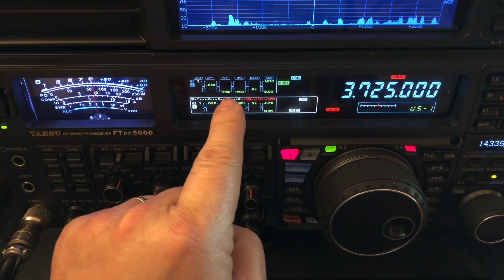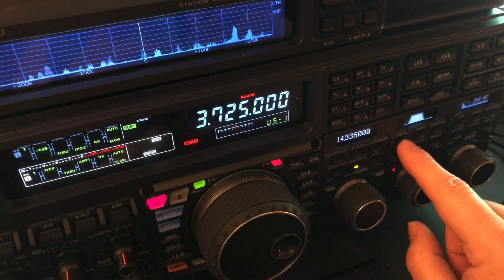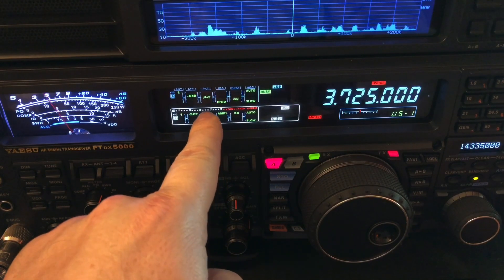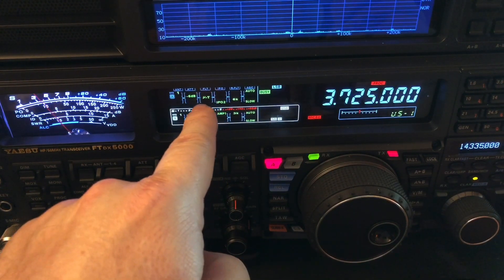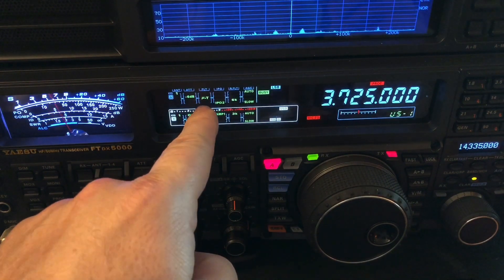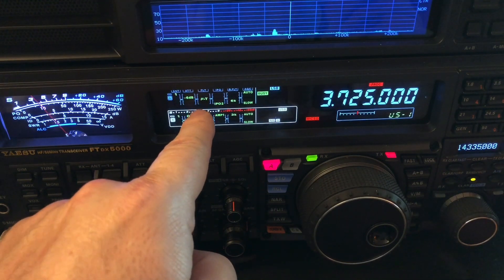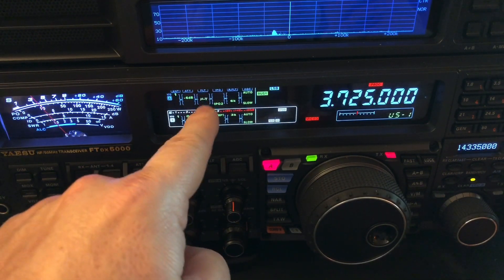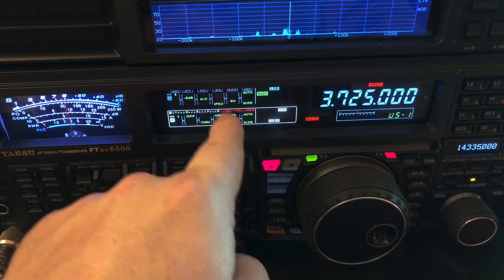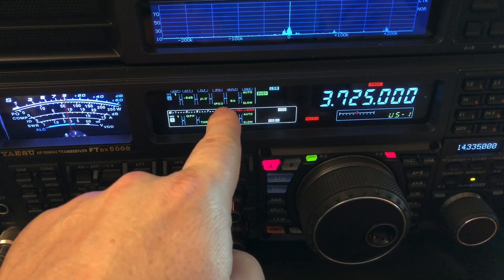If I turn on the mu tuner — it's a button right here — watch the display and you'll see it switch to the little mu micro symbol: microtune. So the external pre-selector is called microtune; the internal one is called VRF. If I had the internal one engaged, it would say VRF right there. Then we have the gain stages of the RF amplifier, again referring back to the block diagram I posted a week or two ago.